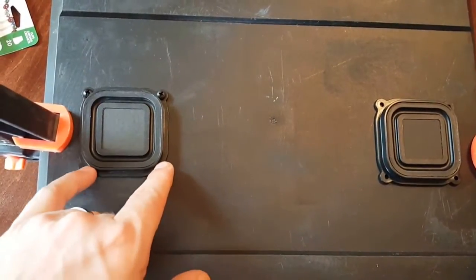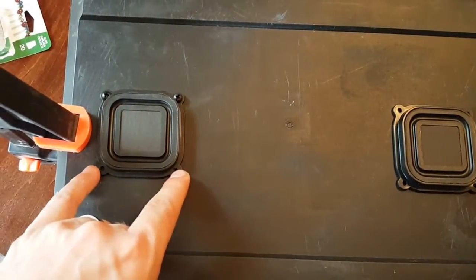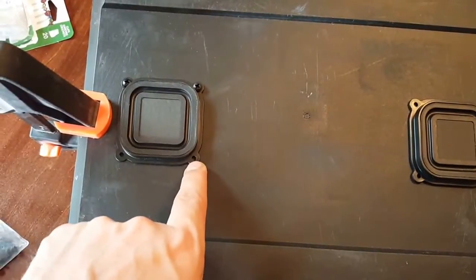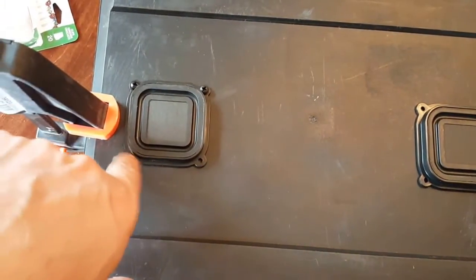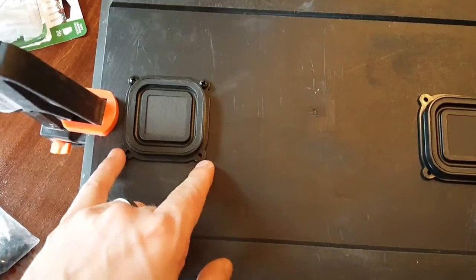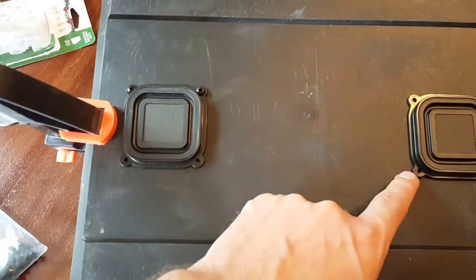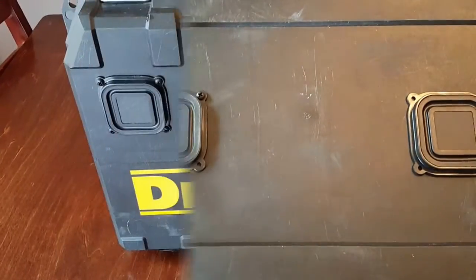I got both screws in. Once you get the two screws in, you can go ahead and drill both remaining screw holes without worrying about it moving. With number six screws, they grab on and drill into the plastic a little — I chose number six because of that. I'm just using three-quarter inch length, so nothing too crazy. You could use a half inch as well and you'd be fine.